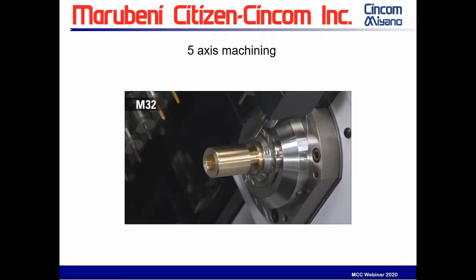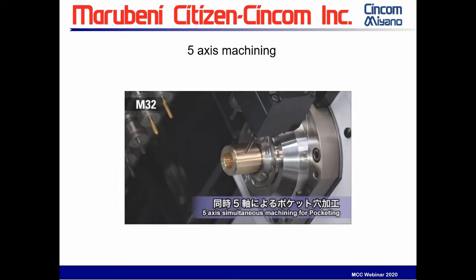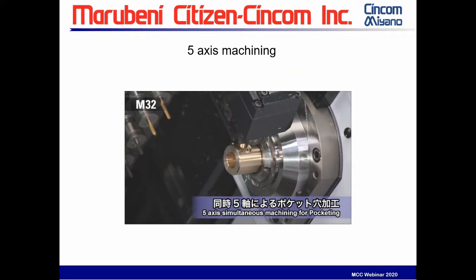The other function is what they call tool center point. This keeps the tip of the tool on the program path. This allows for real five-axis machining. Let's take a look at this operation here. You can see it's a little more complex. A different method of programming, but the Cincom still makes it relatively easy to do. Tool settings are very easy.